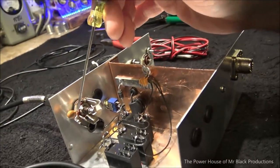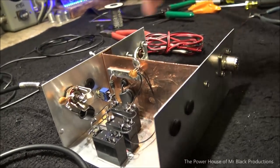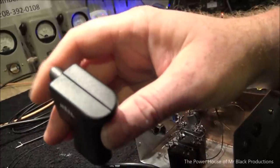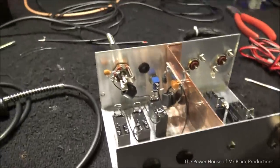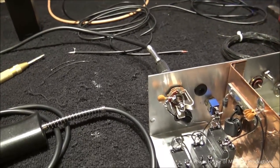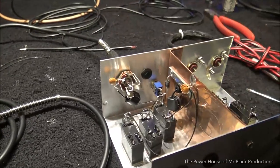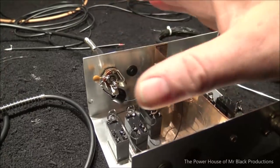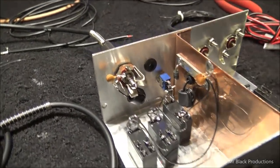And it allows us to keep our remote also isolated. The other thing is that these little tiny disc capacitors are going to help if there's some kind of weird, funky electrical spike. I don't have to worry about my guy getting shocked too overly bad. This will help dissipate that just a little bit. That's the theory, even though the plug on this thing is grounded. It's all in an attempt to make sure that when I ship this thing to the other side of the country, it's not going to come back and the guy's not going to be disappointed. That's the level I'm going to, and that's the reason I'm going to this level.